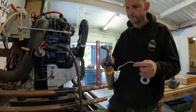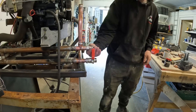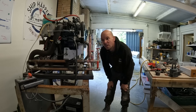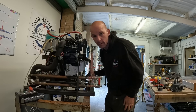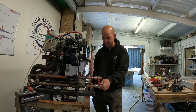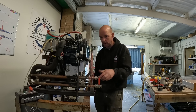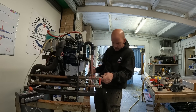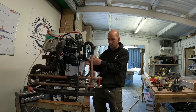So let's do it. With the two valves on now, it's hard to tell whether they're sealed or not, but there could be a bit of pressure testing. Well, they're not hemorrhaging that fast anyway, so good enough for a test. We've got two valves - basically this is our dump so we can dump the salt, and then we're going to get another matching valve to go here. Then we can clean out the loop. Right, so we'll put some hoses on - that bit's sorted. It's all going to be rubbered and stuff like that. Now I need to mount the radiator and then we can figure out the rest of the plumbing.